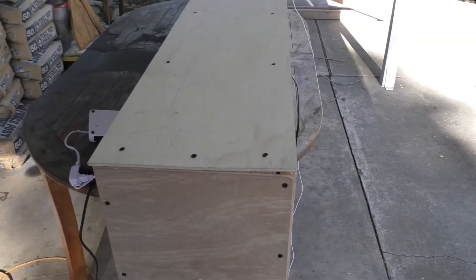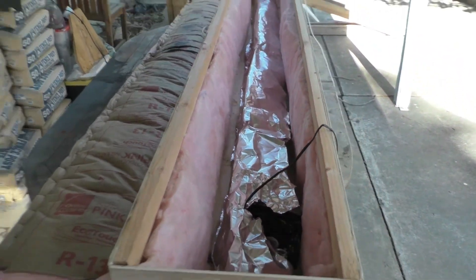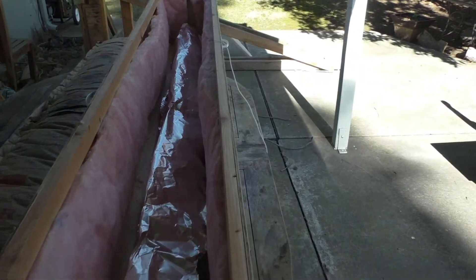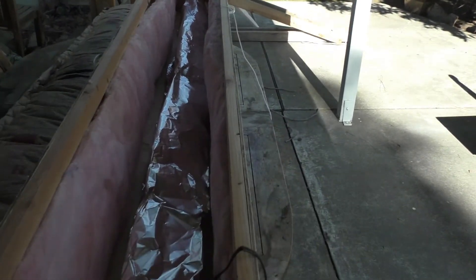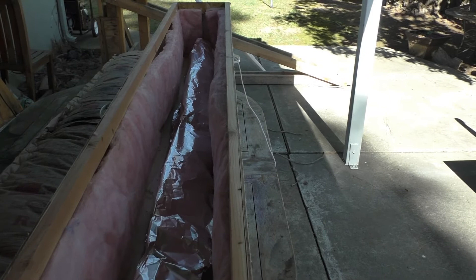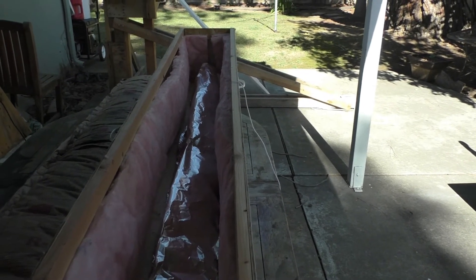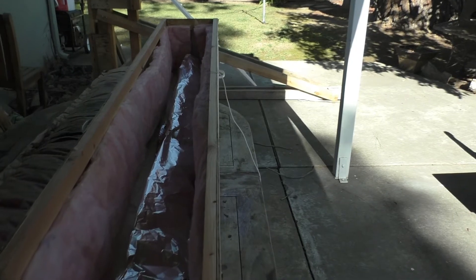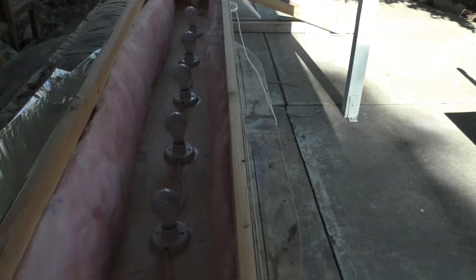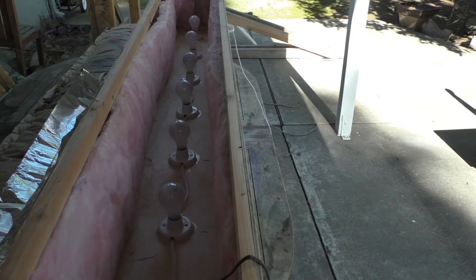Let's turn it off and take a look inside. As you can see, it's a box with insulation — nothing too particularly complicated. I have a very heavy-duty oven-type aluminum foil covering the light bulbs. This is to prevent heat spots on the component you're curing — if the light bulbs are exposed, the radiant heat will vary drastically and you get hot spots that can be bad for the cure. Underneath the aluminum foil you can see the light bulbs themselves. I have eight 100-watt incandescent light bulbs in here — the old-fashioned variety.